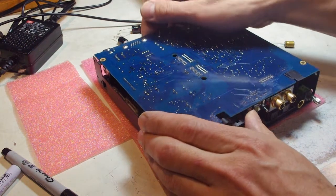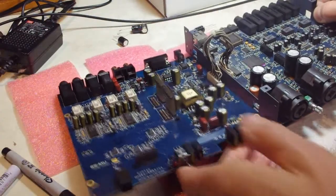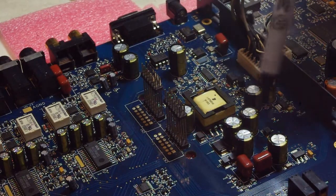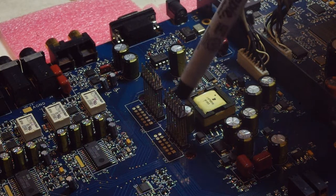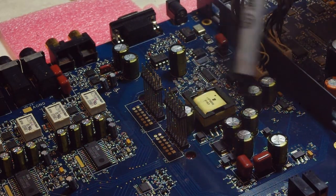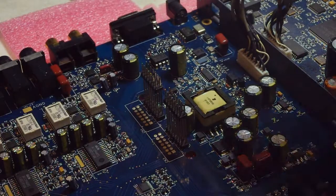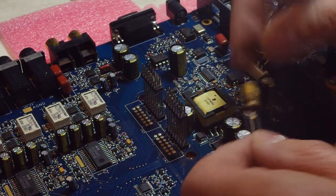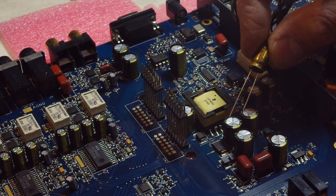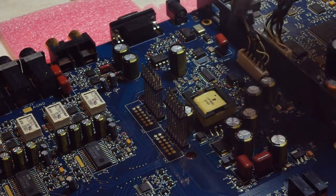Let's open it up. Here's the top side board. Let me show you the capacitors that are giving us a problem — here's the switch mode power supply, and these are the capacitors I'm testing: here, here, here, here, here, here, here, and here. When I checked the DC voltage across them, most have 13 and a half volts, and there's a pair with five volts across them. When I increased the capacitance of those two five-volt capacitors by putting a new capacitor in parallel, that's when I observed that the offensive 12 kilohertz noise disappeared. So I think all I need to do is recap the switch mode power supply and replace these electrolytic capacitors to solve the problem.